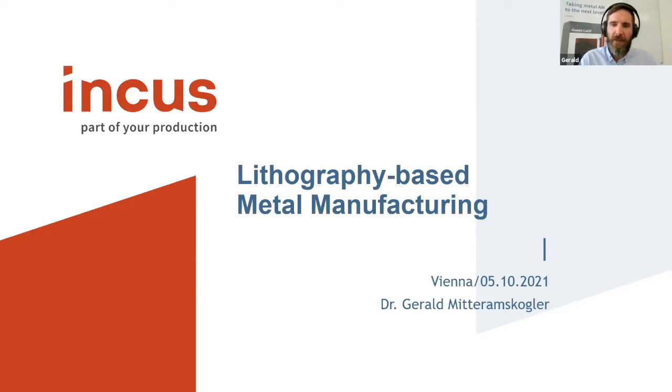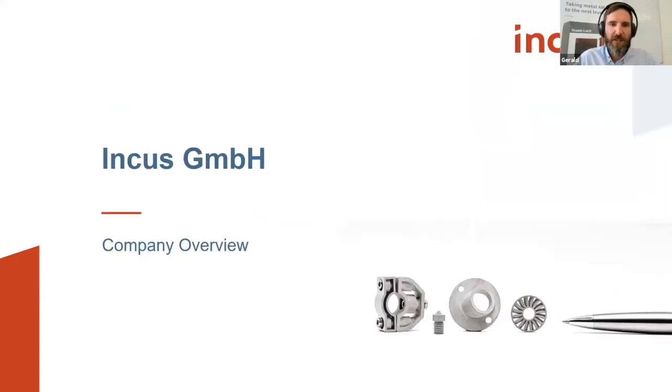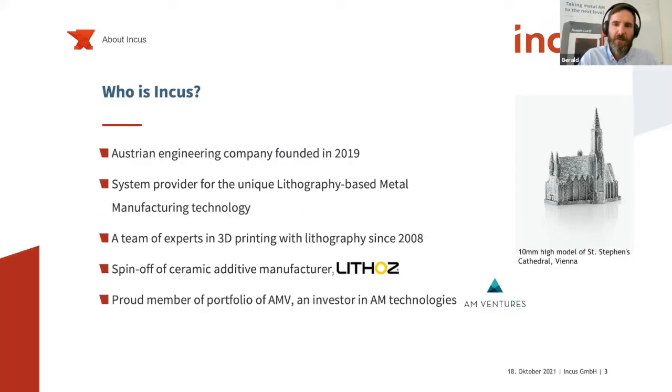Yeah, just a few words about Incus, what we are doing and what we're up to. So basically, we are a technology provider for the additive manufacturing of metal materials. We build the 3D printers, which you will see later on in the presentation, and we provide the respective materials for it. In metal injection molding, you would call it the feedstock. We also call it feedstock, but in our case, the feedstock is a mixture of photopolymers, of a liquid resin with the metal powders inside of them. So it's similar to a metal feedstock, but a little bit different chemistry.